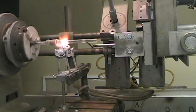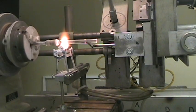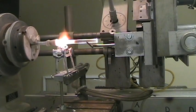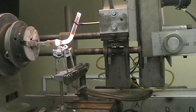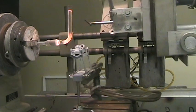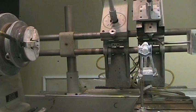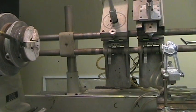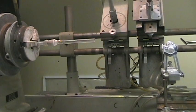Normally I have a number 5 or 6 shield up; I've taken that off so you can see what's going on. As you can see the tube is not straight — it doesn't really have to be. Load another tube up in the holder, check it to see if it's reasonably straight, and tap it in. Like I said, it doesn't have to be real straight, it just has to kind of be there. Push start button.